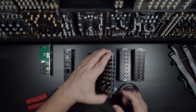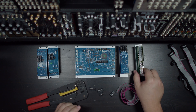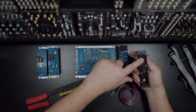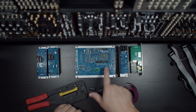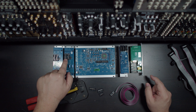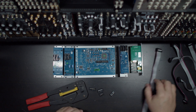If I flip all of this over, keeping in mind that NerdSeq's left is now over here, I'm literally flipping everything over. What I want is the IO on the far left of the modular — because there are HDMI jacks and USB that I don't want all over the modular. So this has to come out of the NSA jack here, over to the Multi-IO, then out of Multi-IO over to more CV, and then out of more CV to more trigger. That's a pretty big leap, and these cables no longer represent those traversals. So the idea is to make some new cables.